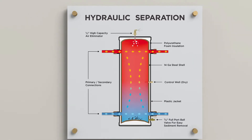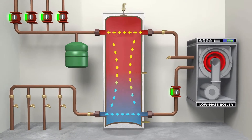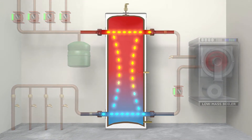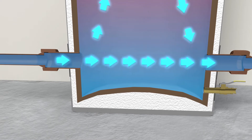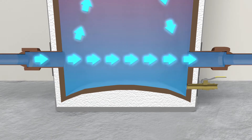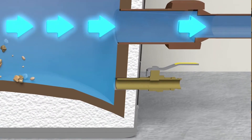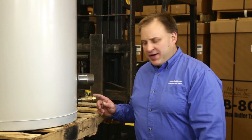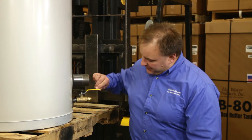It's all about the counterflow. Why is this so important? It's important because the Boiler Buddy causes hydraulic separation. Whether your home is an 80-year-old Victorian house or newly built, you're going to have debris in your line. As water flows back into the Boiler Buddy, it causes such a drastic drop in water pressure that any air or micro-bubbles caught in the water are removed, and the sediment sinks to the bottom where it gathers and stays — all thanks to the change in pressure. Here's where that hose bib valve comes in handy: it's located right at the bottom of the tank where all the sediment gathers, so when the time comes, all you need to do is blow it out of the tank through the ball valve. It's that easy.